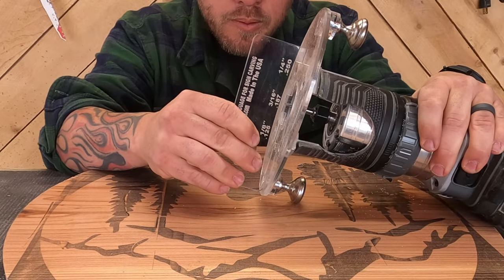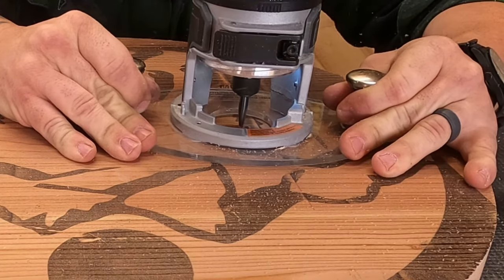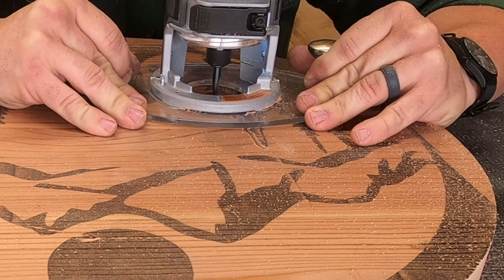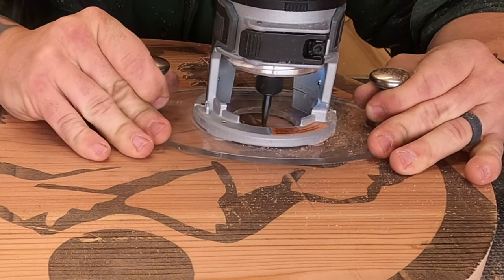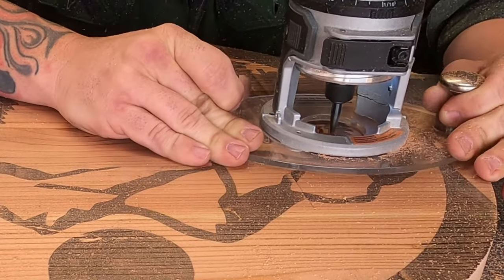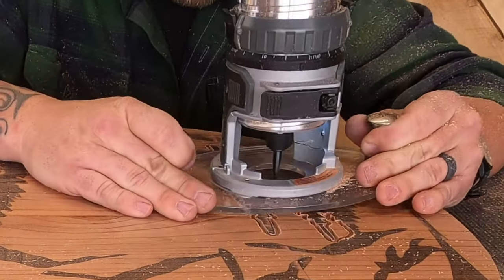The first bit I used was a profile bit at 3/16 of an inch deep. Because this is a pretty good-sized piece of artwork at 18 inches round, there were really no sharp fine points where I had to use our fine detail bit, which is the carving liner. Redwood is hit or miss — sometimes you get redwood that carves like butter, sometimes you just want to burn it. When you're putting multiple pieces together to make one solid board, the grain can be really hard and really soft. As you're pulling the router through, you can hit a hard piece of grain and then go into a soft piece, making it really difficult to keep a straight line.